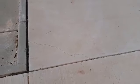I have gone on these calls where this happens on some work that we've done, and I hear the same thing all the time. People point to this part, I'm worried about water getting in here, and I'm looking at 20 feet of crack that's all completely by design. And so the answer is, there is no reason to be concerned with this crack or that crack. They don't get worse. It's all steel reinforced concrete. Really nothing to worry about except for aesthetics. It's ugly. Nobody likes to see a random visible crack like this.